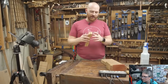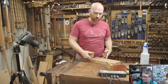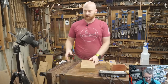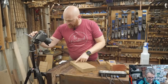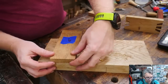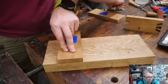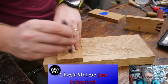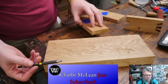First thing we have to do is figure out how in the world we lay this out. To do the layout, you can't just do it on the board — you have to start on another piece. I actually like to grab another board with a jointed edge and use this as a way to draw out what we're actually doing. I'm going to try and do a lot of the up-close shots here so you can see a little bit more. I'm going to grab one of our boards and put it up flush to the end here, and I'm going to draw this board on the surface.